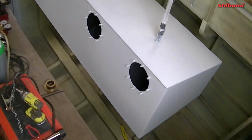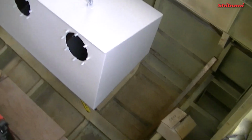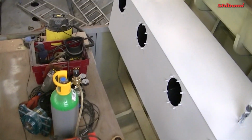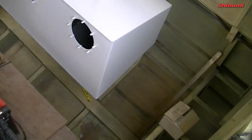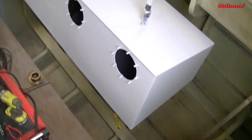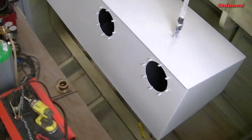So my next plan, which I'm actually designing at the moment, is that I have to make some angle iron of my own because it's a weird angle, 113 degrees to match the back of the tank. So basically I'm going to make frames that have more than 10 mil space all around to allow 5mm rubber for those tanks to sit into them, and then place those on the floor, place the tanks into them, then lift out the tanks and then weld them solidly into place.